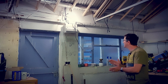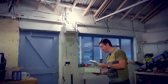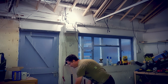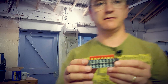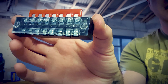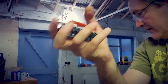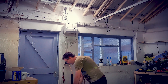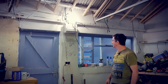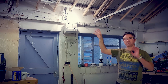I've run all the lighting cable and originally had it set up for some mood lighting — pendants coming down from the steel beams with filament bulbs on a normal circuit with a dimmer switch as the main switch. The rest was going to be Philips Hue controlled by Alexa. But Philips Hue has just brought out some LED filament bulbs, so I've decided to put all the lights on one circuit and control everything from Alexa or my phone.